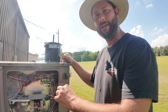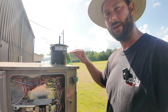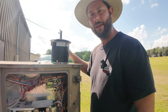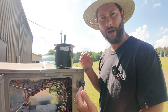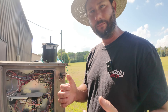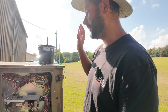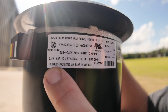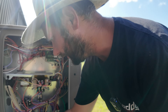While we're waiting for the equipment to run in cooling mode, I want to show you the amp rating for this motor and show you where the power comes from for these outdoor fan motors. Because if we hear a motor that doesn't sound like it's working properly and the bearings could be shot, can we tell which motor it is based off of the amp draw versus the rating? So it's running now — look at the amp rating.